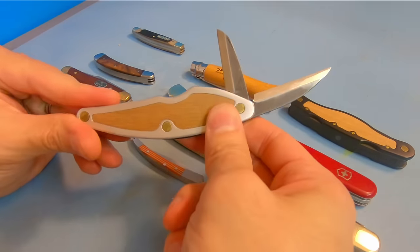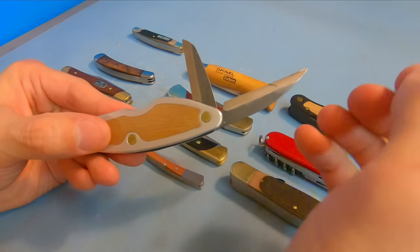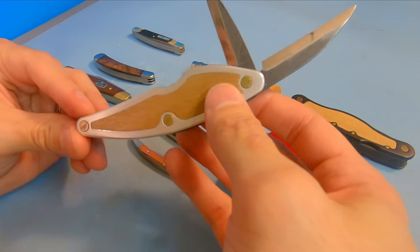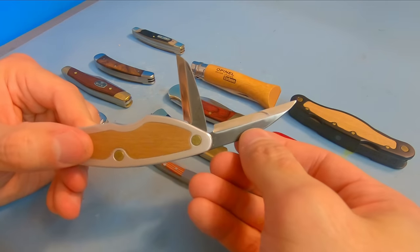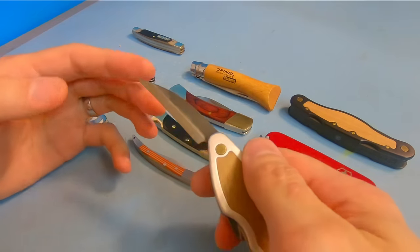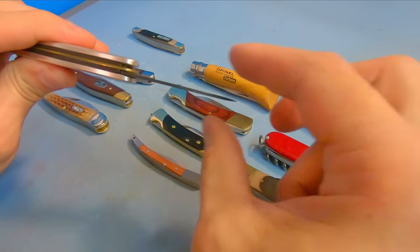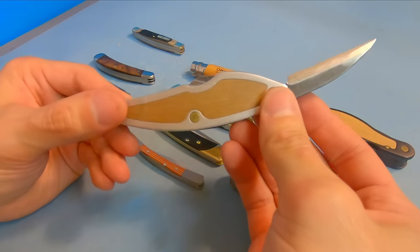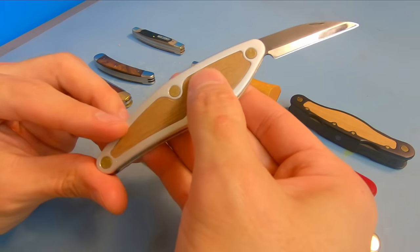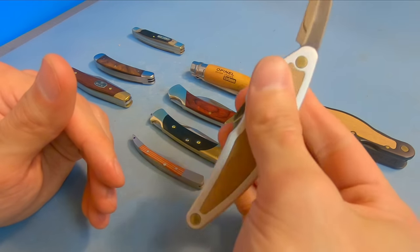This is a great wood carving and whittling knife. It's made by FlexCut, a company that makes wood carving tools, which makes it that much better because they know what they're doing. It's sharp and ready for immediate use right out of the box — no need to hone it. They use high carbon spring steel with a hardness of 59 to 61. The blades are relatively thin, making it pretty good for slicing through wood. They have a pretty nice fit and finish. The wood on the outside feels a bit like a laminate overlay, but nothing weird is poking my hand when I hold it.